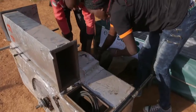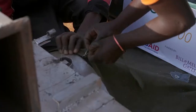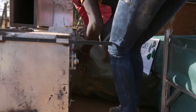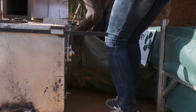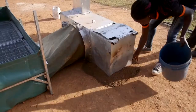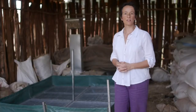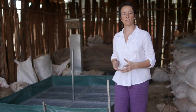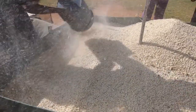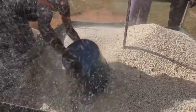Having set up the bed, you position the furnace so the connecting tube is straight and uncreased. The dryer pushes hot air from the furnace up through the maize bed. There should be no gaps between the furnace and the ground. Once you've set up the EasyDry correctly, all other operations are about maximising the speed of drying each batch of maize. The operator must dry at least 3 batches every day to provide the best cost outcome.